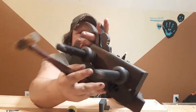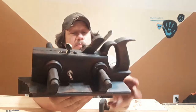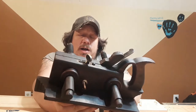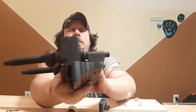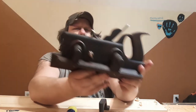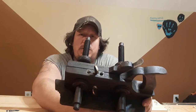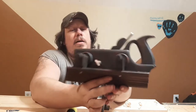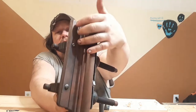These are a little more fragile than your regular planes, so it's not something you really want to bang around. After cleaning it up, all I did was clean it with that wood preserver-finisher stuff — no sanding, no stain, nothing like that. Got it cleaned up, put it back together, just a little wax over the top. And I did end up finding a stamp — there's a '119,' that's the model number — Sandusky Tool from Ohio, which is what I kind of figured. This is the model 119, which is a mid-range; they had fancier ones and simpler ones. The simpler ones wouldn't have the handle, and the nuts wouldn't have the lathe detail like this one does.